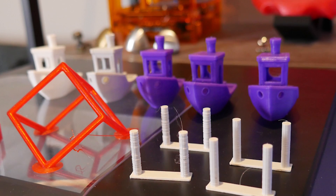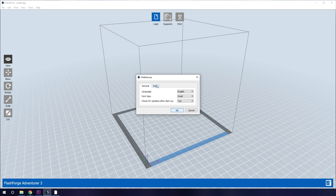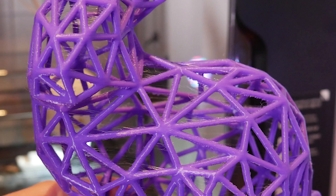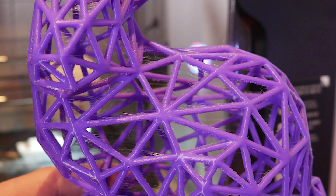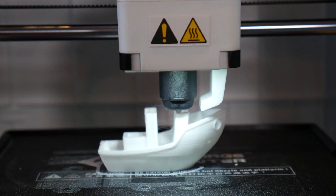I did a lot of tests and slicer tweaks. My buddy Ed, who uses his Adventurer 3 constantly, clued me into the fact that you can unlock advanced settings in FlashPrint, which is mega handy. This Lattice Bunny was printed with no supports and is incredibly challenging — it's certainly an impressive print. I was able to improve but not fully eliminate the wispy strings. This tells me two things: the Adventurer 3 is very much tuned for their own formulation of PLA, and like tier-time printers, you should probably pair it with their own consumables. Also, the cooling fan is inadequate to properly cool PLA, hence the edge curling and subtle stringing issues.